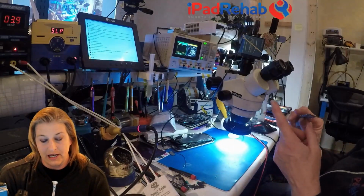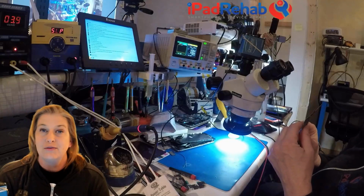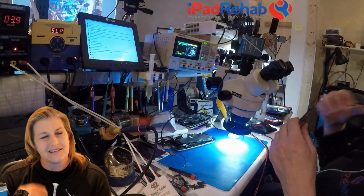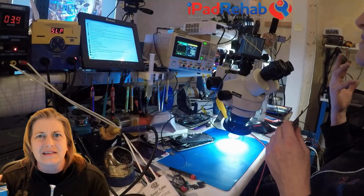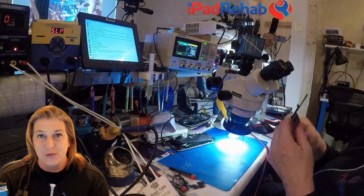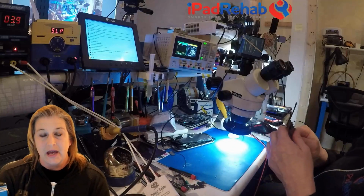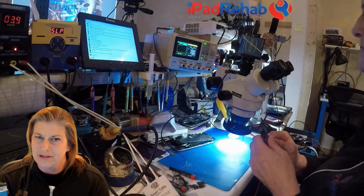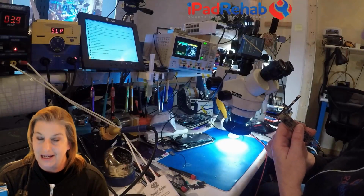You could have a phone with a dead CPU. That's not a short. You could have a phone with a problem on any of these data lines so that it sounds like noise and nobody can understand what they're supposed to do. So an instructions problem. You could have a software problem. None of those are short circuits. So not every problem is a short. Heat, though, heat is a short.